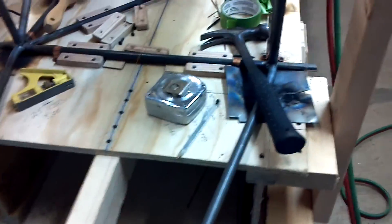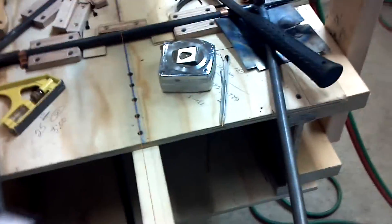At this point I just bent these in — I heated them up. Try to heat it in the same spot so they're both bent the same way. You don't want a real big arc here and a tight bend here because then you have what's called eccentric loading, where the weight gets transferred not so evenly.